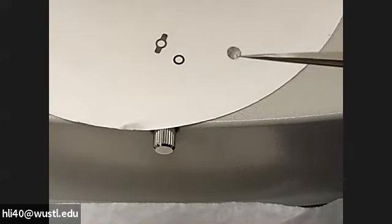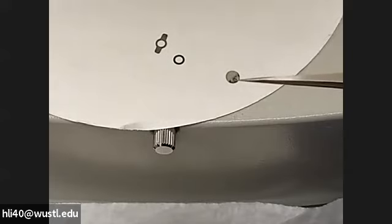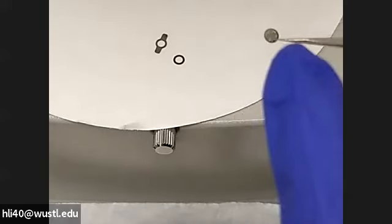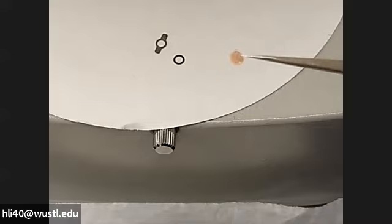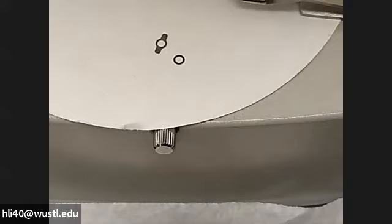So most people sometimes ask me which side to put, it really depends. But for most cases, for this double tilt holder, this is a carbon side, the other is just a grid, okay? So you can see the difference. For this double tilt holder, this carbon side film is facing down, okay, in this way. I'm going to show you again.